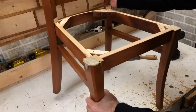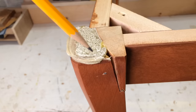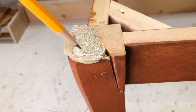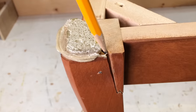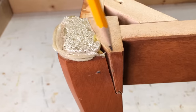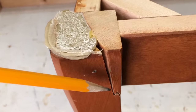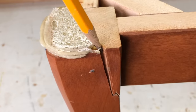We'll stand this chair back up. Wow, look at all that glue. This is a construction adhesive — a polyurethane glue — so it's going to take some work to get that off. And look how big this split is; I can get my whole pencil lead inside that. That's a pretty bad repair. I see a brad nail here, but there's no glue inside that so this should come back together pretty well.